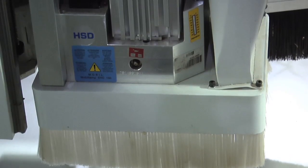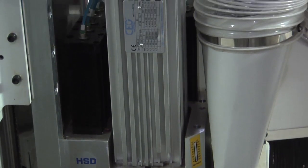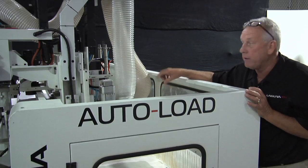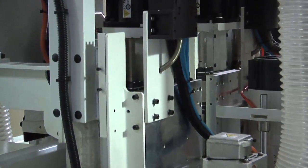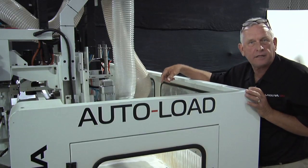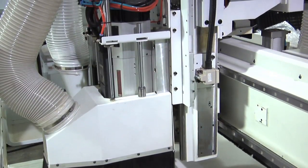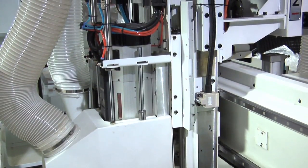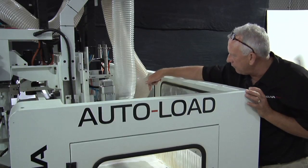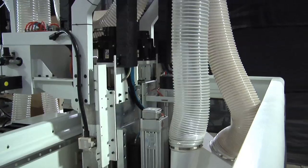The head package on this machine includes a router head — a 12-horsepower HSD head with a tool changer — and an HSD boring block. Each of those heads has its own Z-axis, so there's a lot of mass there. When you plug that mass into the computer model, everything from there back has to be larger in order to have rigidity at the cut. That's why tool frames get larger as you put more on the tool plate.